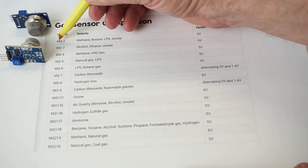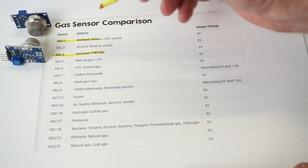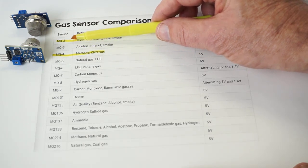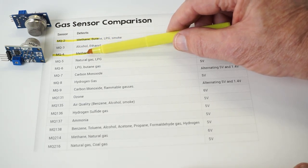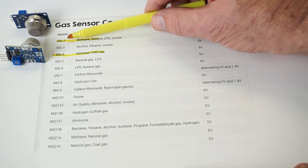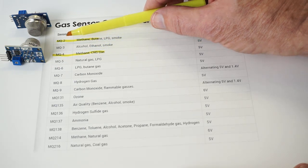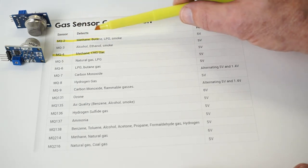I've done calibrations for the MQ2 and the MQ4. Both have been admitted to the HScope database. The underlying voltage on the MQ-4 is higher than the underlying voltage on MQ-2. It's maybe a little quicker to respond to hydrocarbons, but what I like most about the MQ-2 is how quick it is to recover from exposure. The MQ-4 will lag. It takes a lot longer to recover. So that's a very important aspect, and between the two, I prefer the MQ-2 for this type of work.